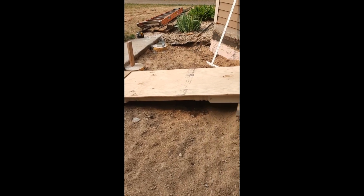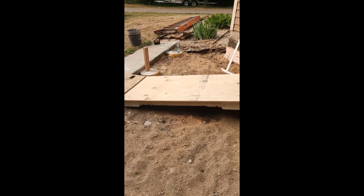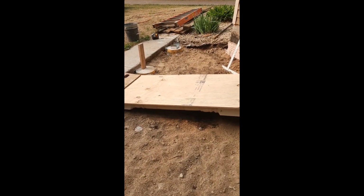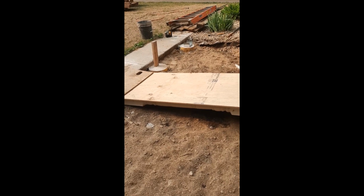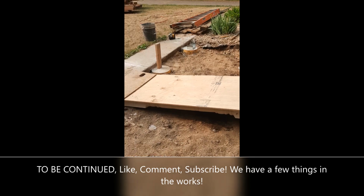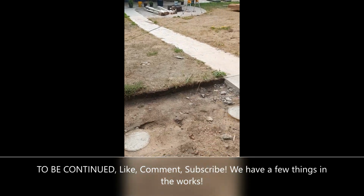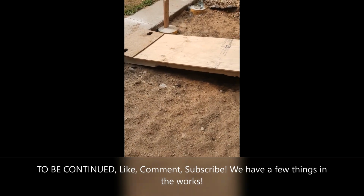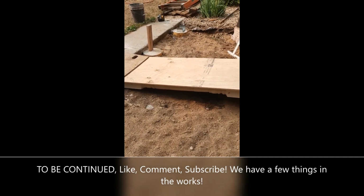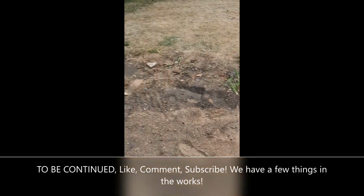Yeah, I had ended up pulling out 7 courses of block through this entire area. It was all dry stack block with no footings, no mortar. It was easy to take apart, but physically taxing. I have a giant pile of cement block back in the woods back there that I'm just stockpiling. So hopefully today we can get some posts standing and get this project rolling.